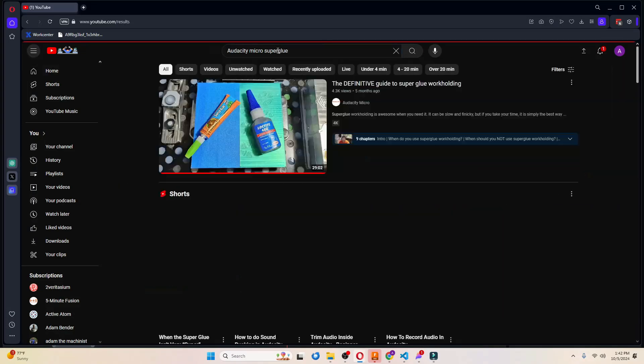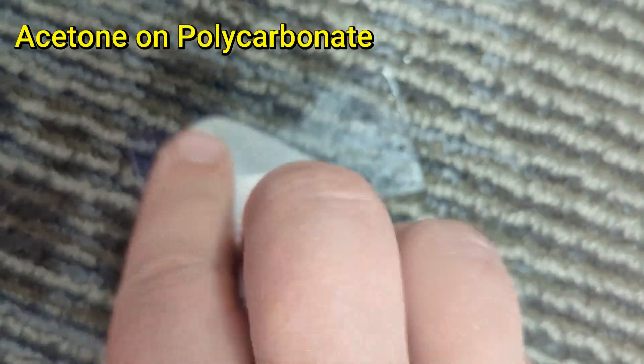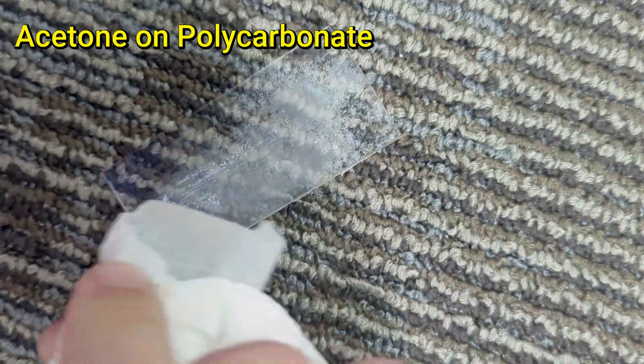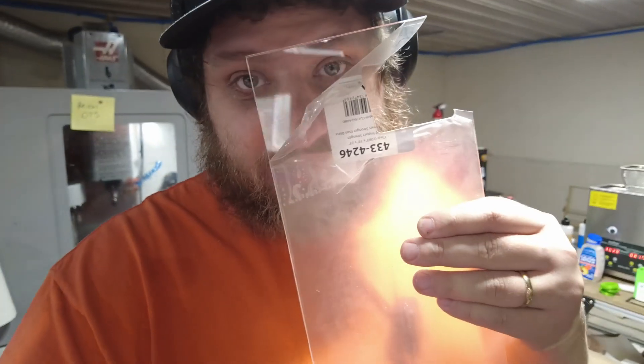I have a whole video up about the superglue method and the exact processes I use. However, those processes fall apart specifically for polycarbonate and acrylic because both of these react to acetone, which you have to use to clean off the superglue when you're done. Plus, many times your customer will want parts out of acrylic because it is optically clear — they may be trying to shine an LED through it or bounce lasers around — so there are extra considerations because it is clear.